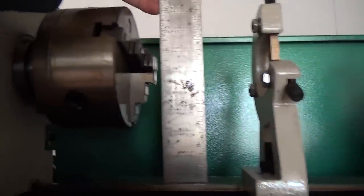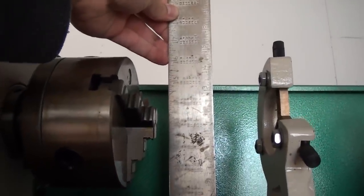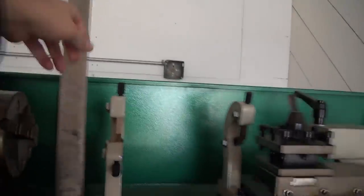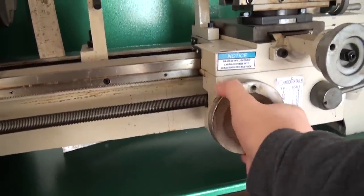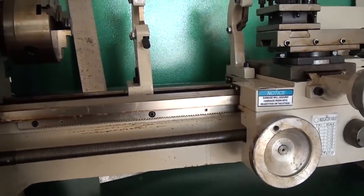The lathe itself is more like 46 by 18 roughly. You can see here that the lathe chuck is about 12 and three-quarter inches off the tabletop, which gives me an overall chuck height of about 51 or 52 inches. Now I'm 5 foot 10, so I really think maybe two or three inches lower would be ideal, but I don't think it's going to be uncomfortable to use it where I've got it.